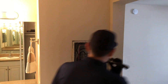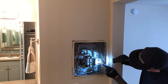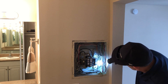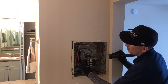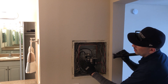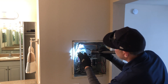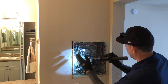While we're in here, I'm looking at the main electric conductors — they look fine. 20 amp and 30 amp for the HVAC system, looks okay, nicely inside. There's no double taps. I see there's a white neutral wire coming into a breaker — I'll note it, I don't think it's a big issue. On sub-electrical panels, the neutral has to be isolated from the electrical panel. I don't see any clips or conductors that are in contact with the panel — that's good.